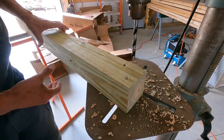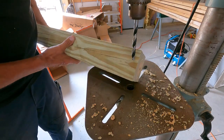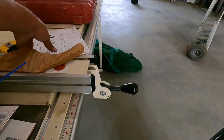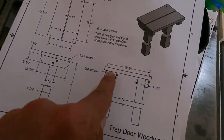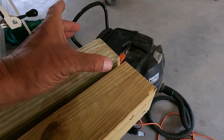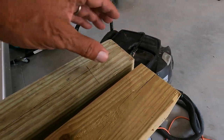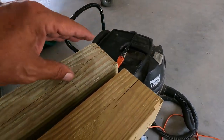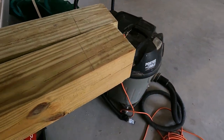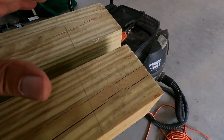I'm drilling a little over three inches into the wood - they're not going all the way through, I'll drill that a little bit later. One last thing on these: they're going to get attached to some cross arms. This cross arm right here is going to be a two by four treated two by four, but where it's attached it can trap water. So what I'm going to do in both of these areas is do a little bit of extra treatment with some copper coat - I'll show you that in a little bit once we get the arms cut.